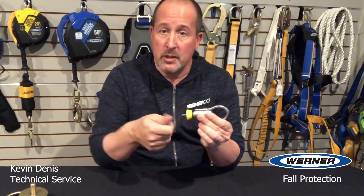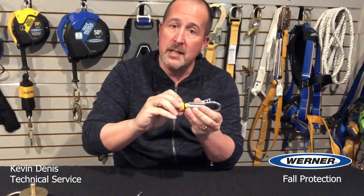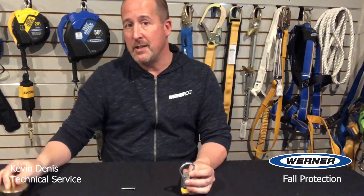After the pour and the form is removed, you'll be left with the yellow plug showing. It unthreads by hand, or you can use a pair of pliers, and you have a couple of choices with the plug: it can be removed and discarded, or the nail can be removed and the plug reinserted into the hole to prevent any contaminants from getting inside. Some locations install several hundred inserts, leave the yellow plug in, and just move a number of the mega swivels around as needed.